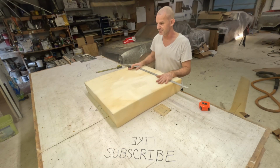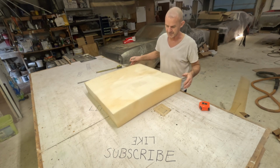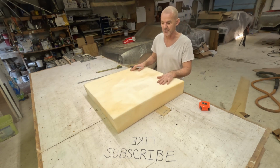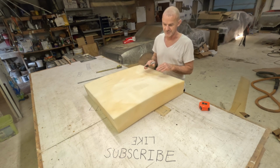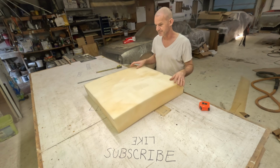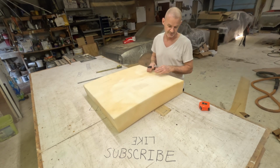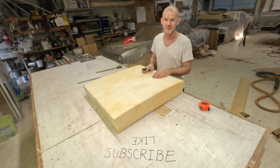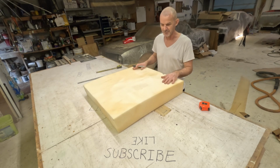This is what I'm going to use to do the bumps, the contours on the bumper. It's just normal foam, but it's resin stable foam. So when I get this to the kind of the shape I like, you'll start getting chunks falling out of it and stuff. But you get it kind of shaped to where you want it, and then you can take and put resin right over the top of this stuff. And then let it cure out, and then go ahead and do body work. Put a little bit of fiberglass on top of it, and then do your body work on top of that to get your mold.